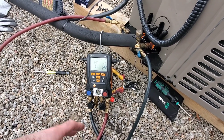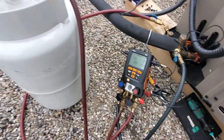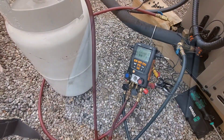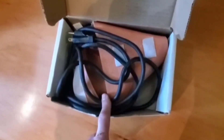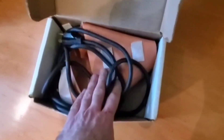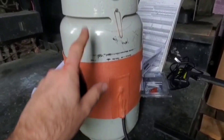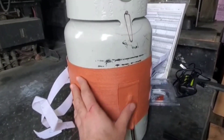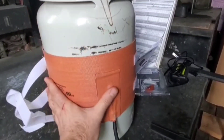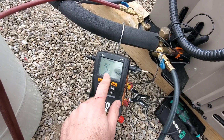After running for about 10 minutes, superheat is around 25°F and subcooling is going up and down between 1.5 and 2.5 degrees — not enough subcooling, so I think we're undercharged. We're gonna have to add some gas. This is a brand new unit, so potentially not enough gas was added during commissioning. Because the low ambient out here kept tank pressure low, I had to warm up my 410A tank. I'm putting a wrap-around tank heater on it — this is a self-regulated heater, and it's going to warm the tank up from about 50 PSI so we can get gas into the system.